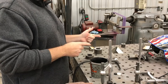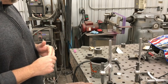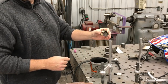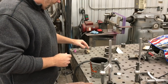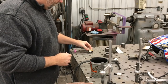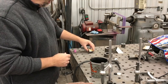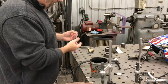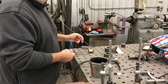Maybe some of the time when I weld hot rolled steel and I get that grayed-over look, it's because of a bad torch angle or too much heat or whatever. Sometimes it's because the metal just doesn't clean and it oxidizes and you can't get a very clean weld. So what I'm going to do in this video is take some of the comments and things that people left in the last video and try to work on it. One of the issues I had in that video was these little cutoff pieces I'm using to test with — they're not very stable.